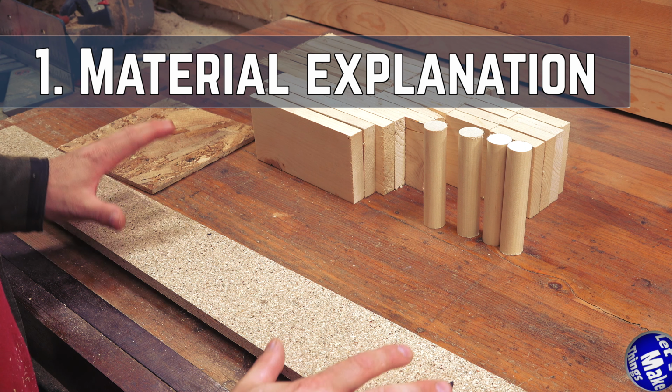Okay, I've got my plate now, and what I want to do is add some double-sided tape to my router base. I'm using outdoor double-sided tape, which is a little bit stickier than the other stuff. Now I'll take this and put the smooth side against the router, and then put this on here so that it's centered. And that should be good right there. Now I can flip this over and find my holes that I need to mark.